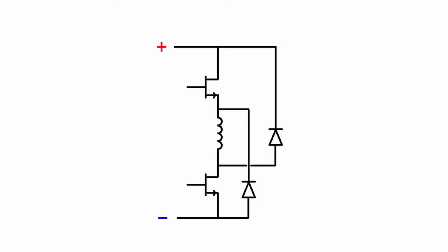Not as quickly as the first circuit with only a transistor, because that's going to destroy things. But we want something that turns off the current much faster than this. So this is where we get to the circuit that actually works, the circuit that I actually used here, and that a lot of commercial switch reluctance motor drives also use. And it looks like this. So it is a circuit that has two switching devices, or two transistors, and also two diodes.